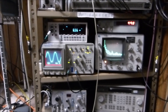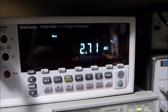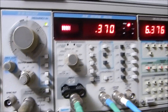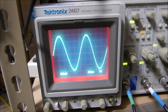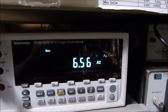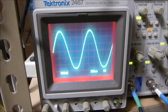Now if I put negative feedback in — flip the switch — it's a power ratio of 5-to-1; it dropped to 1.5 watts equivalent. Running back up to 5 watts, THD is down to 0.36% — really quite good. It starts clipping at about 6.5 watts again, and distortion is still pretty low at 2%.